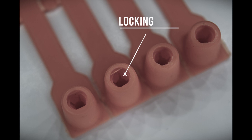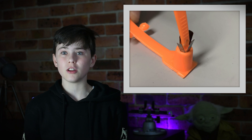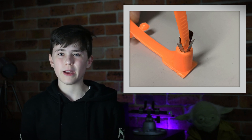The locking mechanism has four small teeth inside. The plug goes in sliding past these teeth and then they latch on so you can't pull it back out. Attacking these teeth was the first way we tried bypassing the seal. We cut four small shims then slid them into the locking mechanism and slowly pulled the plug out. It worked but it left marks on the plastic because of the shims, and we also had to pull on the seal — not the best way, and it won't pass if someone inspects it closely for tampering.